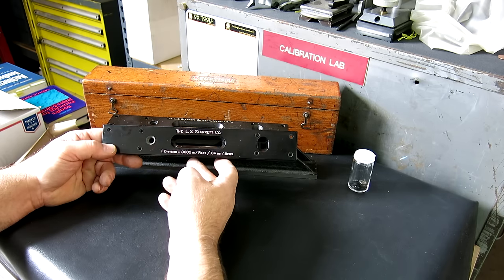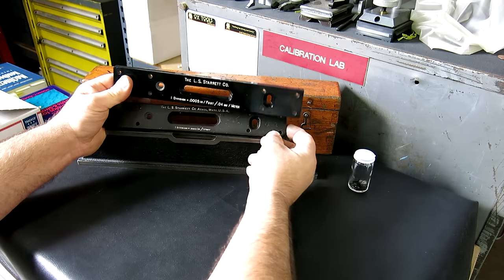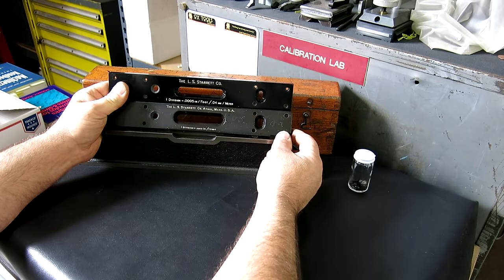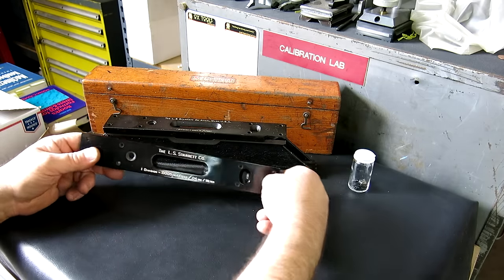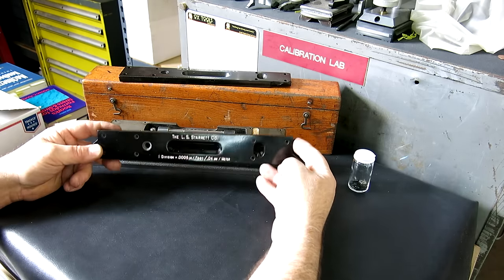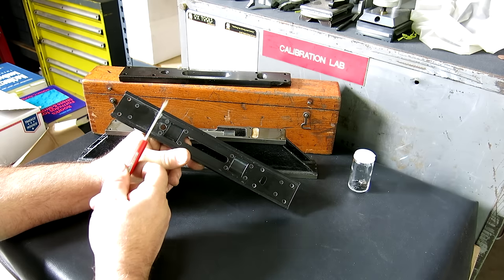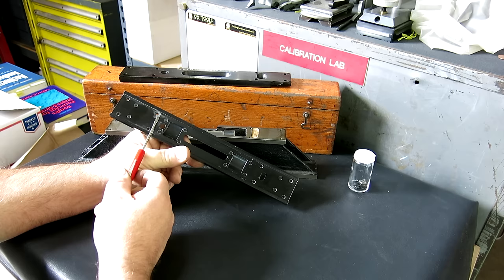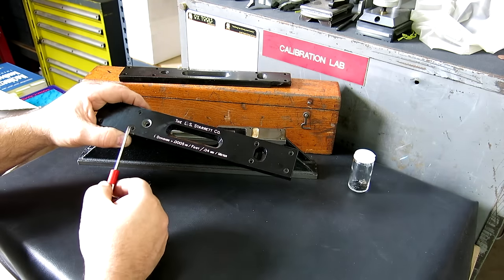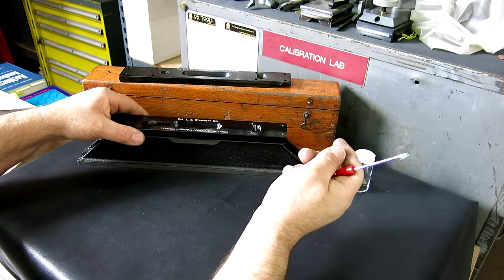It is made out of phenolic, believe it or not — not a urethane or anything like that. And here's the homage to the metric system: they've changed the top plate just a little bit. One division is five tenths of an inch per foot or four hundredths of a millimeter per meter. Now here's something I think is actually kind of funny — we talked about machining phenolic and how it wants to chip and break. Well, our friends at Starrett had some problems. They pushed that drill through there a little too hard and blew that material out — this is why I know it's phenolic. And where they threaded this hole there's some fracturing around that. The thread doesn't look too awesome in there, but the top is acceptable. So there's our new top plate.